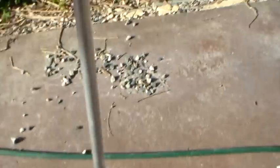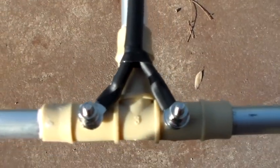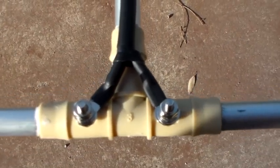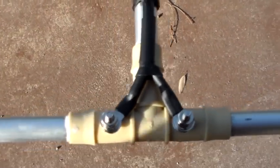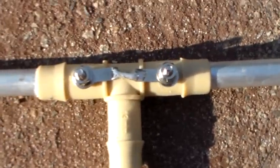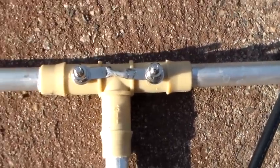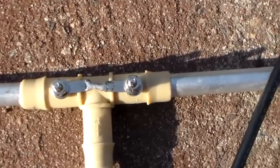So you can see there's the boom it's on, and I'll put the termination on there. I'm going to weatherproof that termination by putting some gunk on it before I paint the antenna with the disruptive pattern. And the same of course goes for the other side, the reflector side. I'll cut those bolts down to the nuts and put some weatherproofing stuff on that before I paint it.